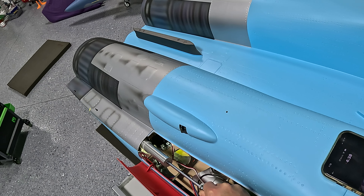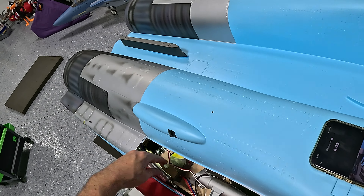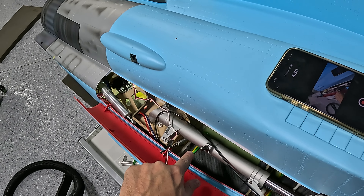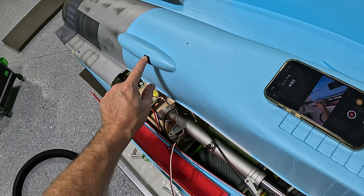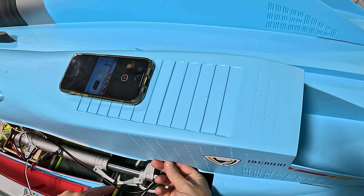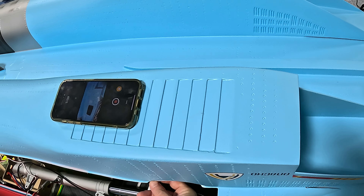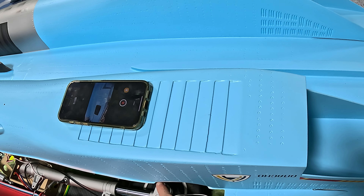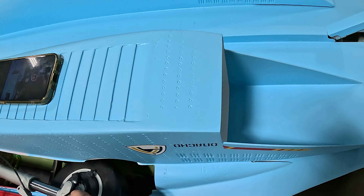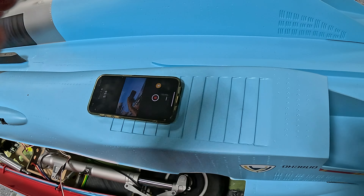This is a heavy duty piston — hopefully they don't leak. I gotta take all this hose out now. I cleaned up the little locking ball that goes into this thing because they were rusted — cleaned them up. I noticed that the wheel is hitting as it comes out, hitting right here. This area is real flimsy, so if you wanted to, you could put some resin and some glass in here to kind of stiffen that up. I do have to trim this corner because when the wheel comes out, it's hitting. Just an easy little trim.